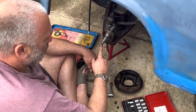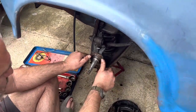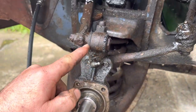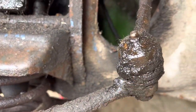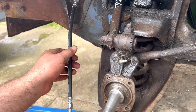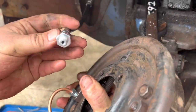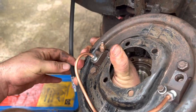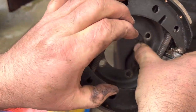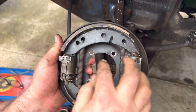We're going to do the brakes today on the Austin A35, 1958. The secret with the brakes is cleanliness. The flexible brake hose goes into the pistons on the brake shoe — that hose pumps the fluid into the piston, which pushes that little rod upwards. That makes the brakes work; they're connected so that both pistons work together.